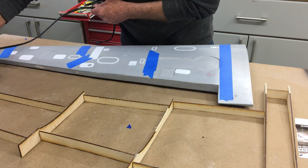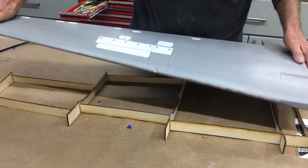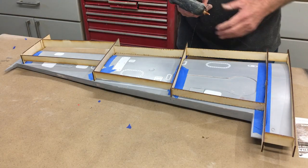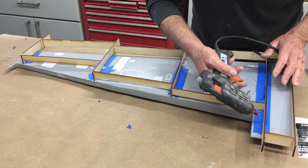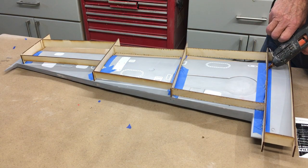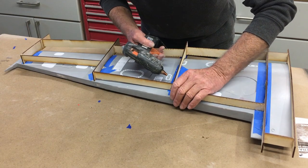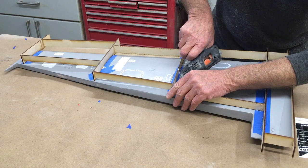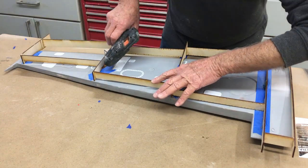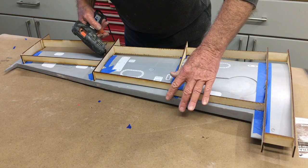A bit there and a bit here. Now I'm just gonna whip the wing in there. I have to be right on the edge. The spot glue worked — I was able to turn it upside down. So I'm just gonna get a few dabs of glue, just a few blobs there and there, just to hold the frame together. And don't worry, this will all pull off real easy. Make sure that this one is set back because that's where I'm gonna be putting a parting plane. I'm not going crazy with the glue — just a few spots here and there just to secure it.